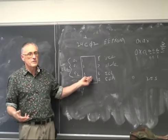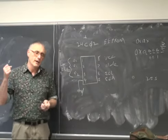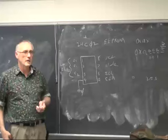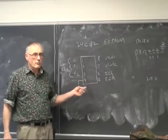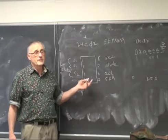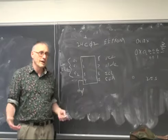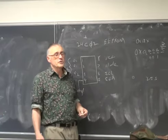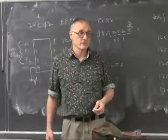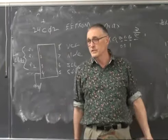So if these were made with bigger junctions, they would retain data better. I have no idea if they do or not. I expect that all of them are dominated by cosmic ray strikes. One strikes a transistor and you lose the data. Now, in terms of write cycles, how many write cycles can you produce? That depends on how the system is built. If it's FRAM, ferroelectric RAM, it has 1 billion write cycles. If it's fairly low voltage flash memory, then it's 10,000 or 100,000 write cycles, or maybe 1 million. Depends on the physical characteristics of the memory, and there's no way to predict except to look at the data sheet.